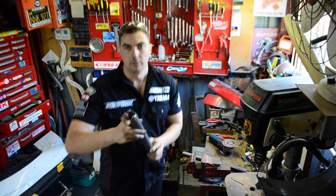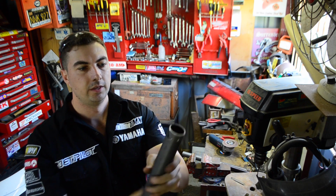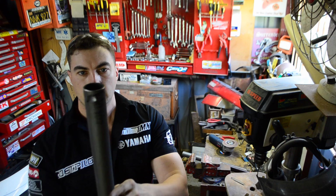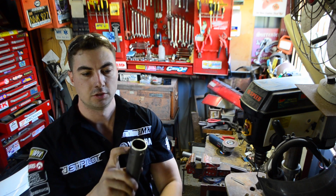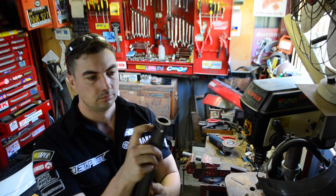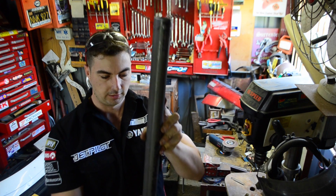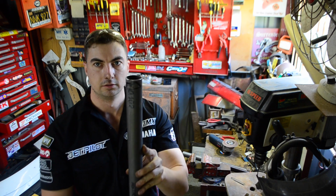Right, we got that trimmed out. Now, next part will be that first line we made. If the pipe is 1.5 inches, you go 1/3, half an inch, back from your line, becomes your thread line. And then from the center to the outsides, in line with your notch, and that should give you your notch for the other side.